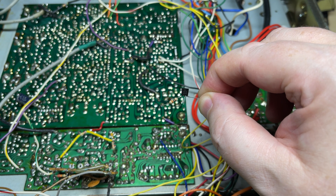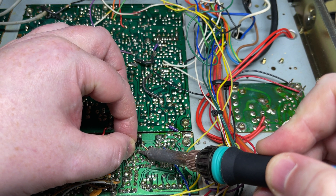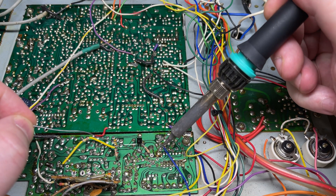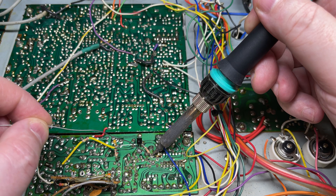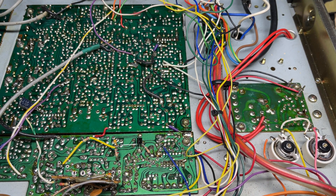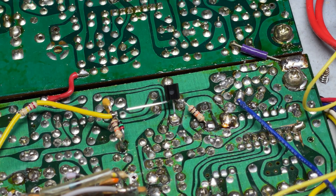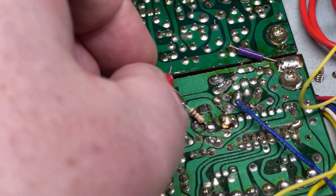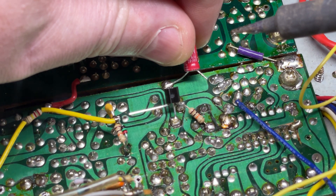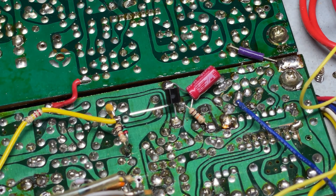The modification on my Concord shows it as having a 10k resistor. I've actually measured the voltage on my Concord and the voltage drop across the resistor is practically nothing, so I think it's just there for protection. So we'll solder that into place - we've soldered the center leg of the regulator into place, which is the negative. Now we're going to do this slightly differently than what's on the Concord. As the Concord is being fed from 13.8 volts, we're going to feed this from the 9 volt side of the AVR. But first we'll put back the 10 microfarad capacitor, which is also in the Concord modification.